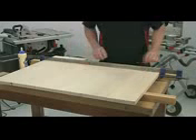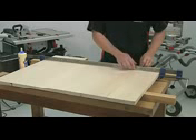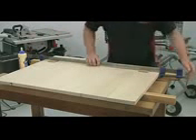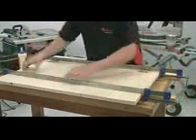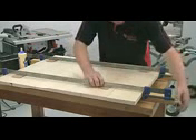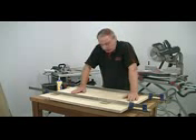There's another very important point: when you tighten up the cramp, glue is going to squeeze out at all these joints. If this glue comes into contact with the metal of the cramp bar it's going to leave a dark stain — in just a few hours it will stain the wood to quite a considerable depth. So it's really important to keep the cramp bar out of contact with the timber. I just use a couple of off-cuts of MDF to jack it up a fraction, then squeeze up nice and tight. You shouldn't have to wind on tremendous pressure if the joints have been machined properly in the first place.